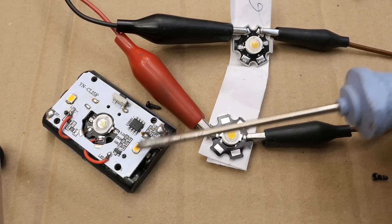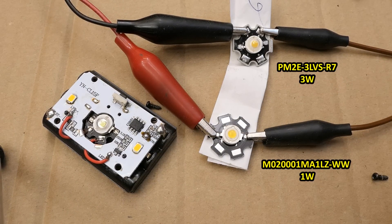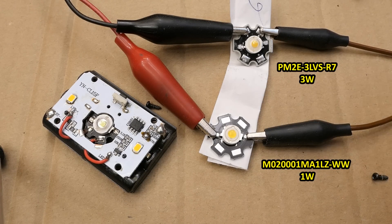The phosphor-yellow LEDs have a much wider spectrum and could almost be called very warm white LEDs. I'm going to choose from these two: one is one watt, one is three watts, but it doesn't matter much because it's going to run at one watt anyway. More headroom is better, of course.